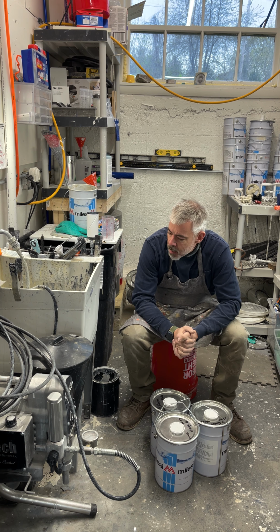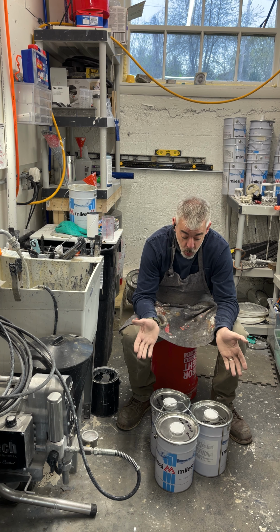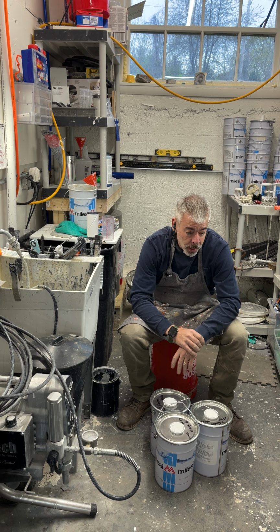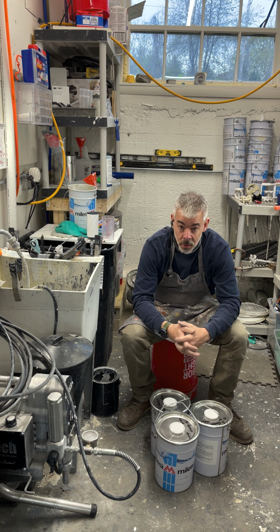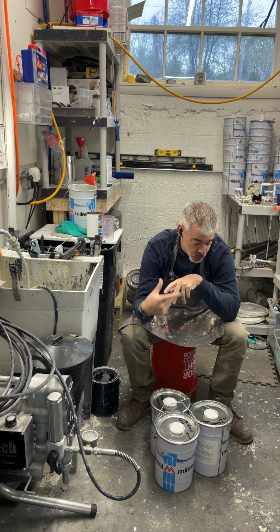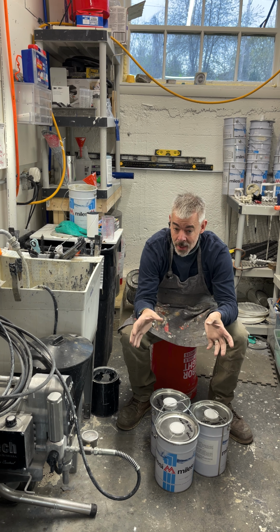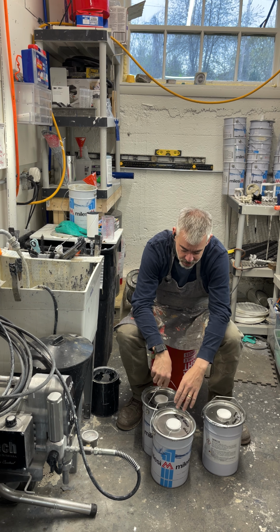Today we are going to talk about something that happens every job that contains more than 1 gallon of paint. It's for color consistency through the gallons. Now, as you may or may not know, the paint store has a machine that dispenses colorants into the cans. And so your paint guy will say, okay, you want St. George white. He types that in, he makes a gallon. Then he gets another gallon and he types in St. George white and he makes another gallon. And he goes through that for as many gallons as you need. In this case, we needed 3 gallons.